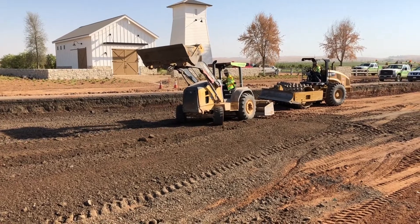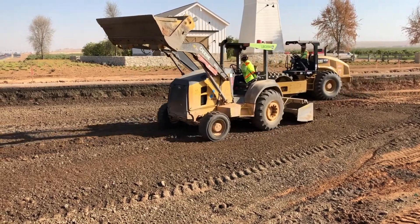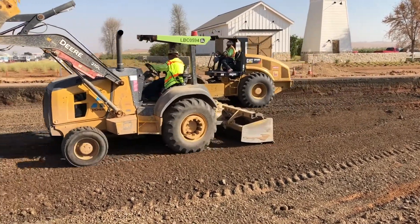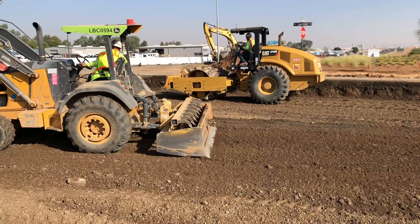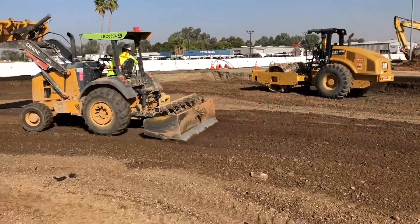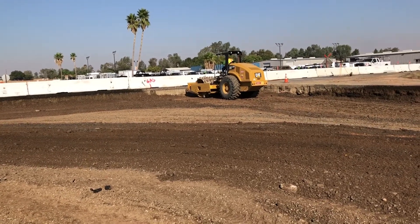This last clip is a much more common grading operation. You can see two pieces of equipment: a skip loader, which is a tractor with a scraper box on the back, and then a single-drum sheep's foot compactor just behind it, working on compaction with a water truck. This is for a future road, and they're just starting to lay base rock down on top of the existing native soil material. These operations will typically include a tractor, compactor, a blade — a 14 or a 16 — and sometimes a 623 scraper to move excess material where it needs to go.